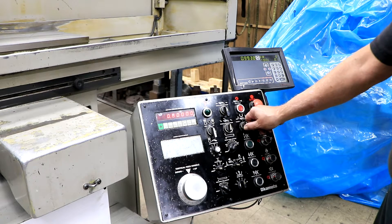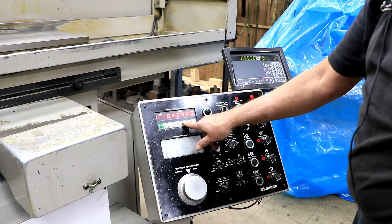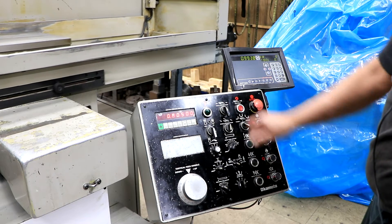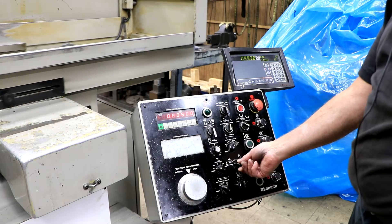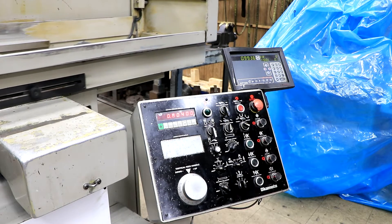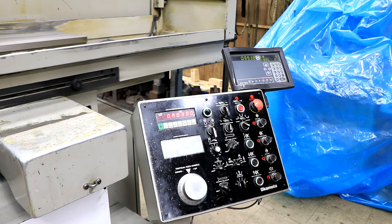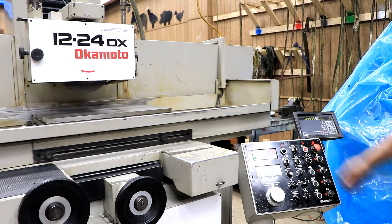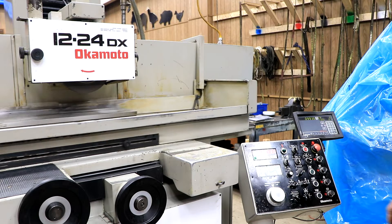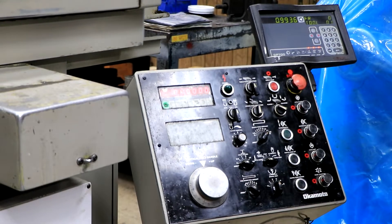The other type of plunge it can do is the plunge number one, where you've got to go to edit and put some kind of number in — let's put 5 back in. Then we start the table, and the feed's not going to start until I go down into what they call auto-sizing, or automatic. We're only going to feed on one side of the chuck; it has to come all the way back to this side, and that's what the arrow shows you. This is taking a lot less material off but a lot less pressure on the grinding wheel. There's also a fine feed that can be thrown in here — you can grind down to a couple of tenths and then start feeding the last couple of passes at a lesser value.